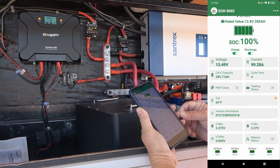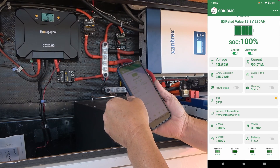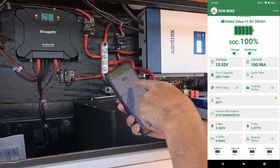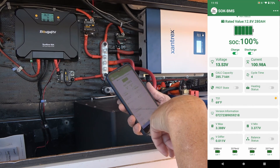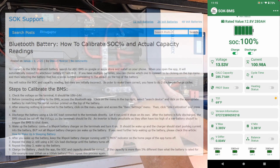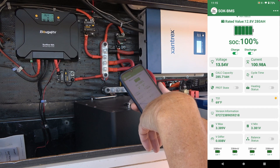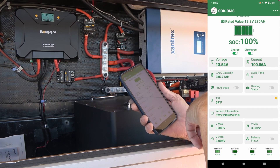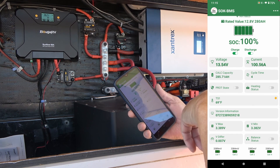I'm going to let it charge at about 100 amps and see if it handles it for a longer period. It seems to handle that no problem. One thing I've noticed with this app is it doesn't track the percentage very well. When I was doing the discharge test, it didn't budge off 100% even though the voltage would suggest otherwise. There is a FAQ online about calibrating it — discharging the battery all the way to zero and then charging it to 100%, maybe twice, before it becomes accurate. I've had the battery down pretty low a couple of times but it still hasn't been accurate. It's a small thing, and maybe I'm just not getting it adjusted properly yet. Good news is it's handling 100 amps no problem.